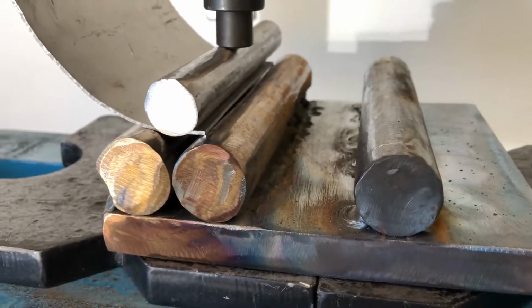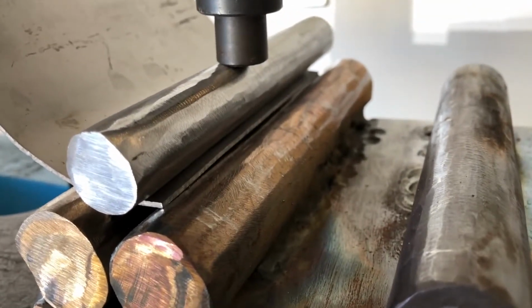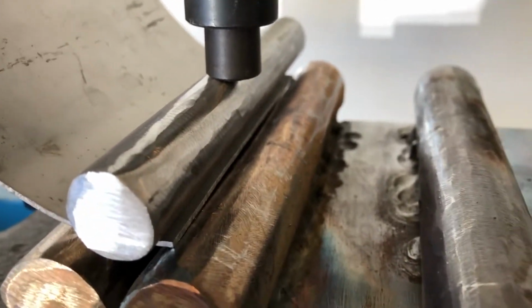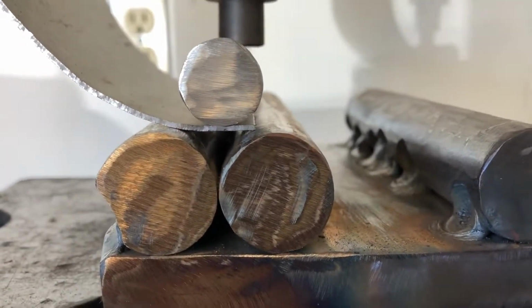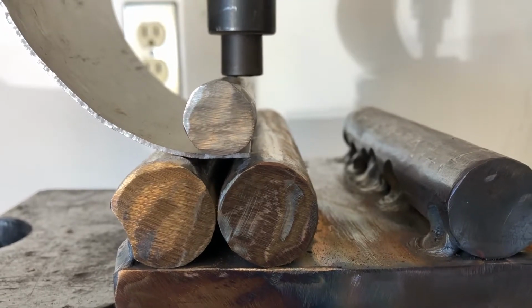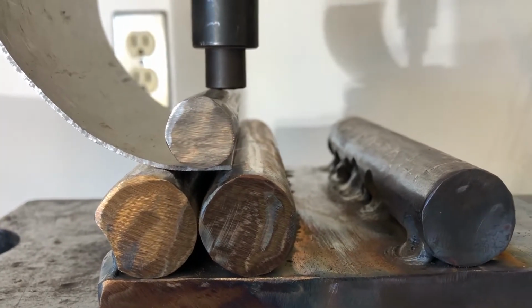So this is what I'm doing to get that nice bend. I have the rod, which I'm pushing down into the titanium sheet. I've got it really close to the edge of the sheet. And then when I press it down, it doesn't get caught. I notice I haven't lined up the press there. That's not the best thing. So let's see what we get for that.